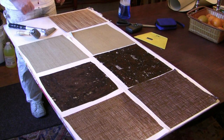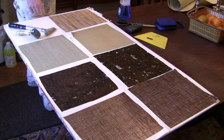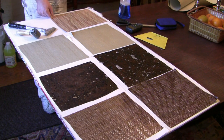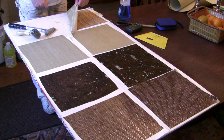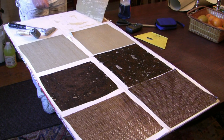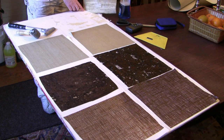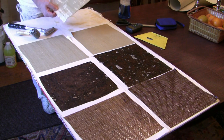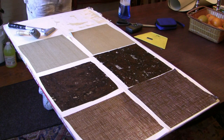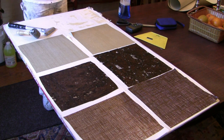These samples have been soaking now for about 25 minutes, and I've sprayed them three times — that's usually enough. With the regular grass cloth, no problem. See how it's all saturated. There's nothing to stop it from being saturated, so it comes off like a snap, and then you just wet that down and scrape it off. Grass cloth is very easy to remove.